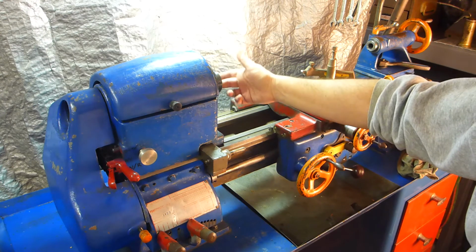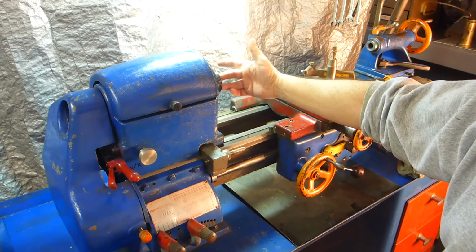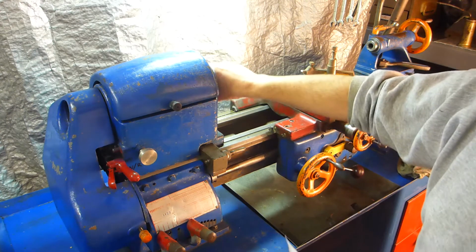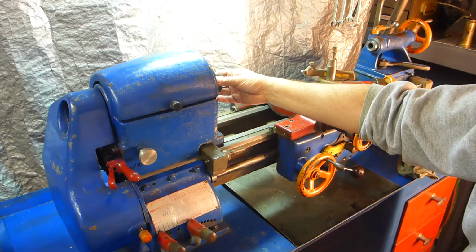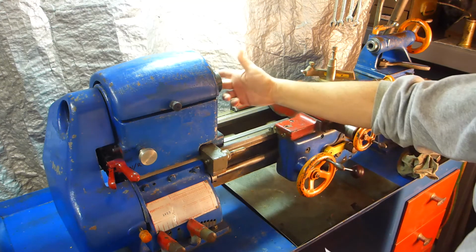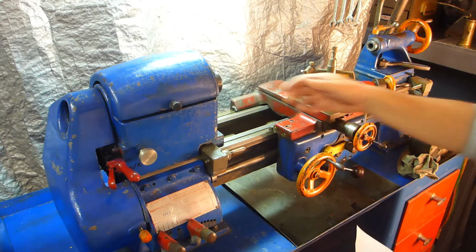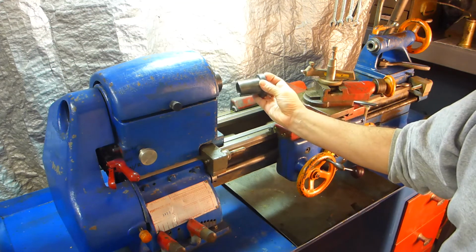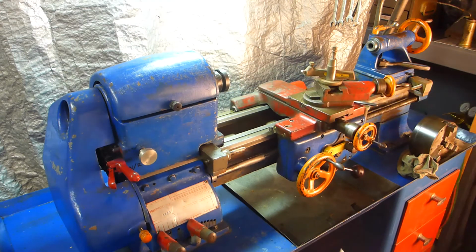All right, the spindle. This is what really sets it apart from what I've had to deal with so far. It's a 1 5/8 large bore, and the spindle thread is 2 1/4 by 8 threads per inch. The taper inside the spindle is proprietary, I think. That's the collet adapter. So I'll measure it out at some point and verify that it is the proprietary Logan taper.